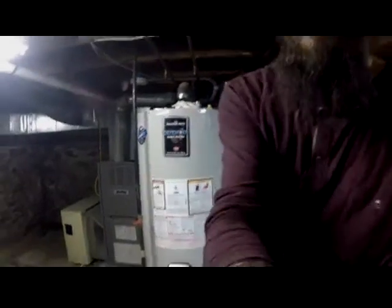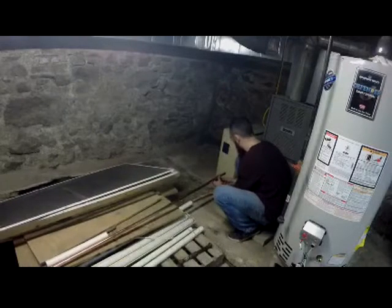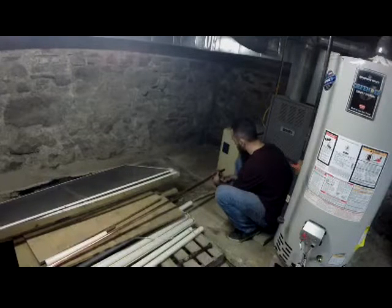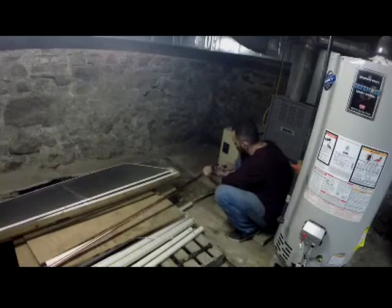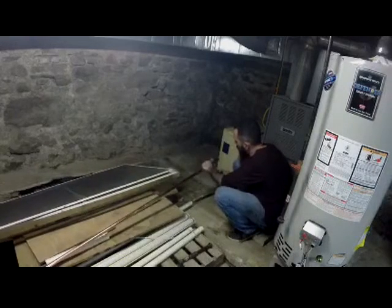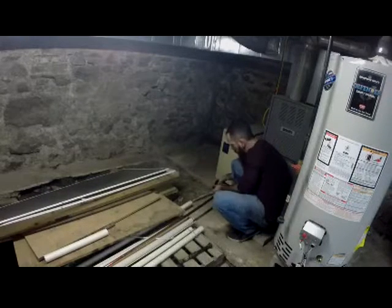So go to the first piece. Just take your pipe cutter. Okay, just going to take a little piece here, open this thing up until it fits around. Now, I don't need a very big piece, so a little bit on, so it's a little bit tight here. Go around, tighten a little more, go around, tighten a little more, around, tighten a little more, until it falls off. Okay? Here's one piece.